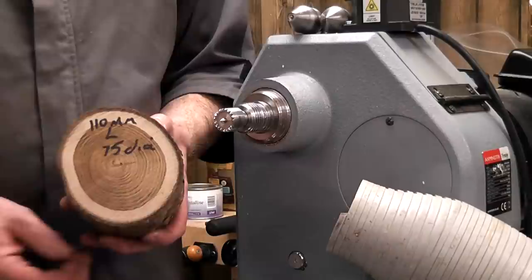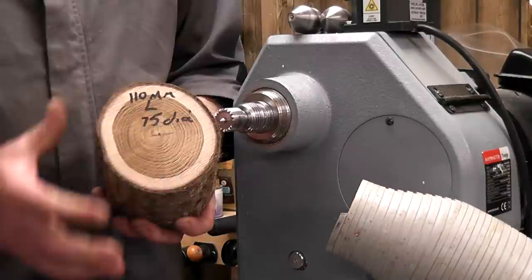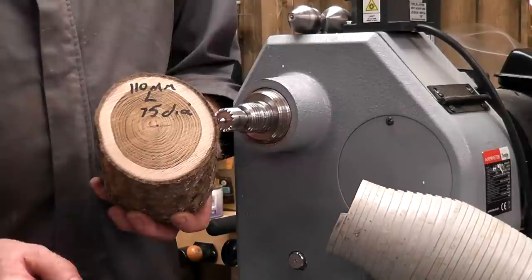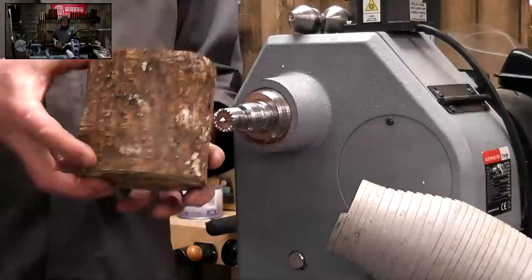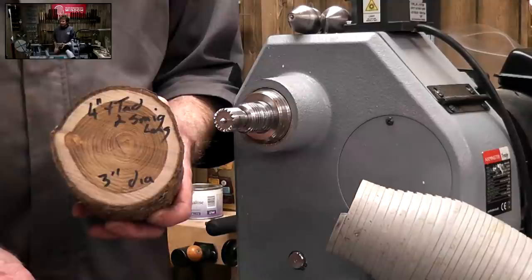Ben's doing the cameras, Craig's doing the questions. So this is 110mm long, 75mm diameter, approximate - it's not critical. Don't go over four inches for a box, because you've got to get your hands over the front. Over four inches makes it difficult to take the lids on and off, and ladies tend to buy boxes more than gents, so they've got smaller hands - three inch diameter is a nice size. For those working in imperial measurements, this is four inch a tad and a smidgen long.